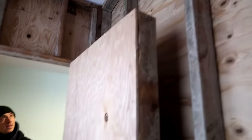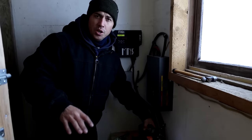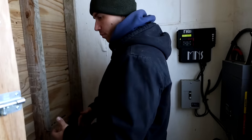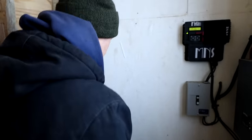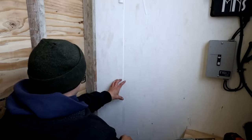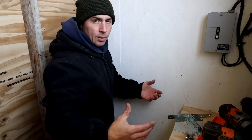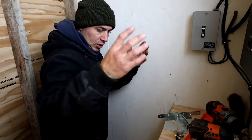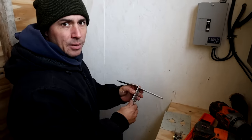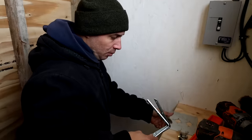There's plenty of light in here — that light's done. Let's heat this place up. The heater's going to go in the same equipment room — it's almost like a closet — where we have all the solar stuff. I'm kind of designing this as we go. I'm going to put the diesel heater somewhere around here. We need to mount a fuel tank and then have the diesel heater come through the wall, aiming it kind of low. Heat rises, so if you heat it low, hopefully it'll circulate better. I'm going to use L-brackets to hold it in place, get it leveled off, and mount it on.